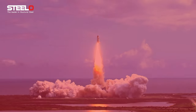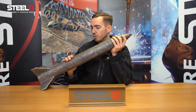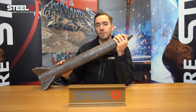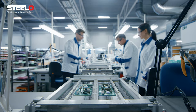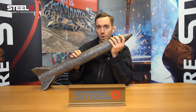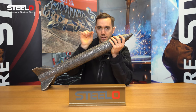A rocket is actually a fairly simple object. I know we call it rocket science, because trust me there's a lot of physics and maths happening behind the scenes, but all in all what we need is a body which holds the fuel and also the engine. The reason why it is more beneficial to 3D print a rocket is because you can easily alter the size of the rocket. Also, the biggest issue with traditionally made rockets are all the attachment points — inside you would have various components which need to attach to the skin. When we print, we can actually create these handles or mounting plates within the structure. Those normally are considered the weak points because that is where the fatigue happens, whereas here we can neatly build over in order to evenly distribute the load that happens on that plate.